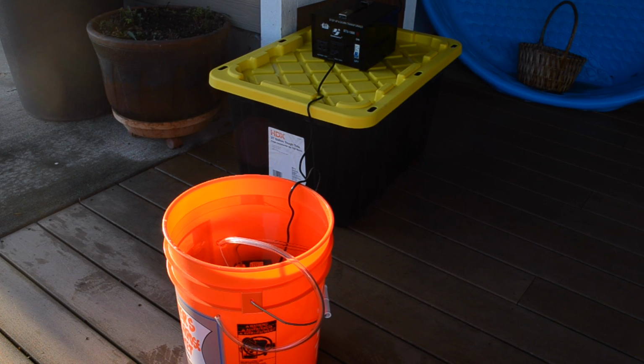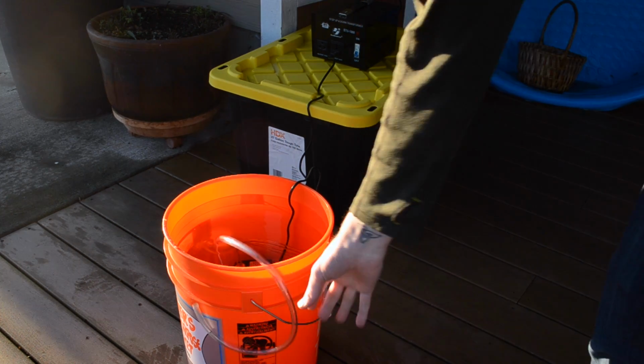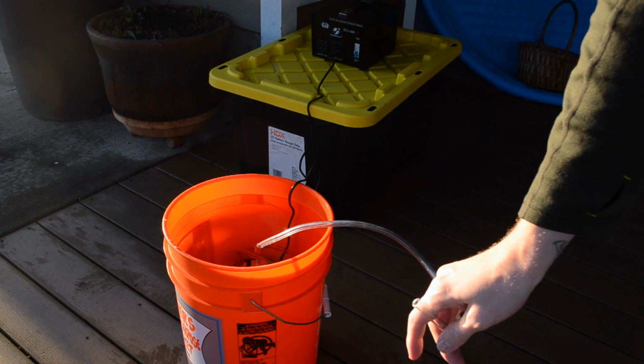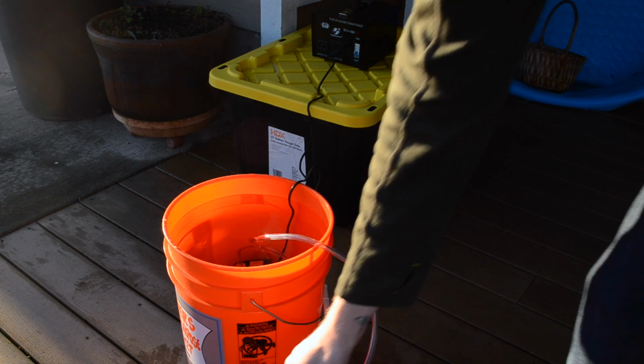This is the last of our pump tests. This one is the Chinese pump that's rated at 1,200 liters per hour. That works out to be this 5-gallon bucket in a shade over a minute if it's running as claimed. The adapter that they provided with the laser cutter goes to roughly this size tubing, which is a separate adapter than the pump comes with. So it's one that looks like they included separately. So I'm sure that the flow restriction will limit the pump's output quite a bit.